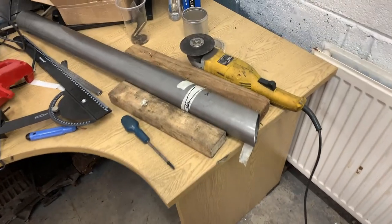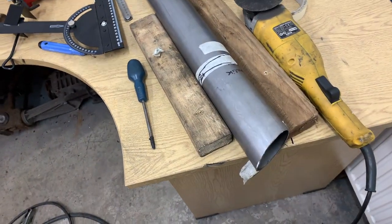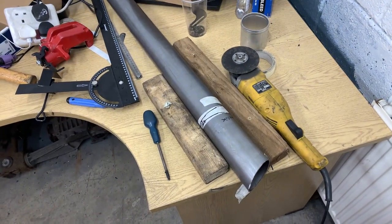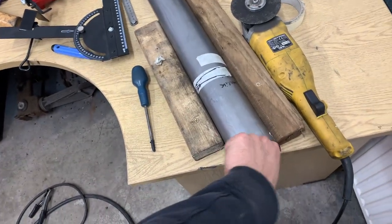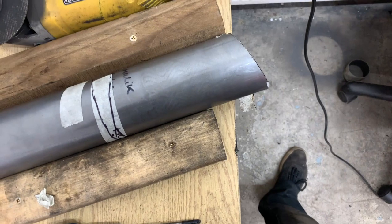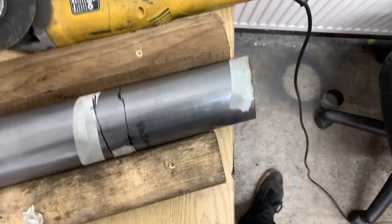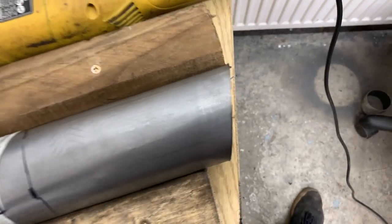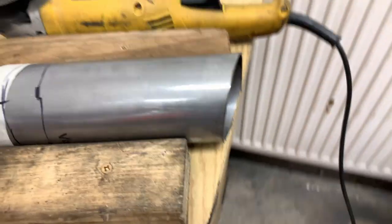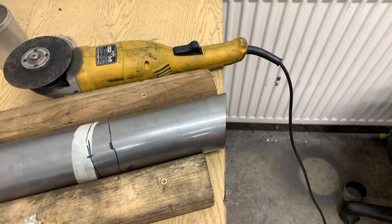To show you how I made that pie cut angle: I brought a protractor, set it off against the bench and marked it at 17 degrees because that's where I wanted my angle to be. Then Vass hammered in two pieces of wood to make a jig, and I simply used the 90 degree angle coming off the table as my cut line. You can see that this edge, when put against it, creates the angle - that's what I used to cut those pie cut angles.